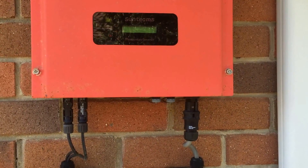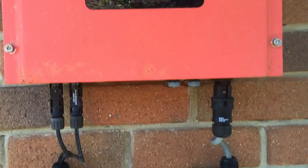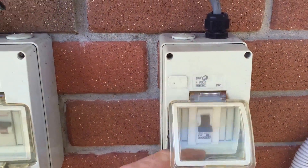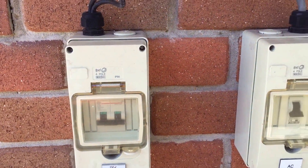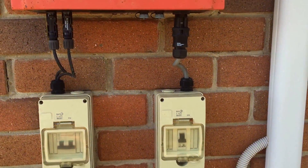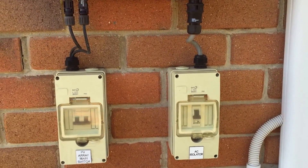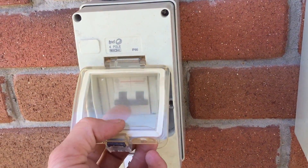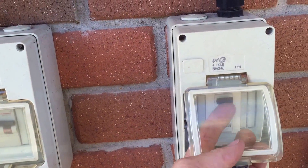But in this case there's nothing at all. So what we can try is rebooting the system — we'll turn off the AC, then turn off the DC, and see if the system will reboot when we turn it back on. It doesn't matter the order turning back on, but it's always important to turn the AC off first, then the DC off.